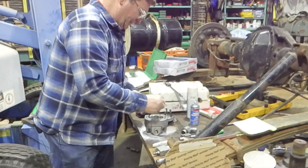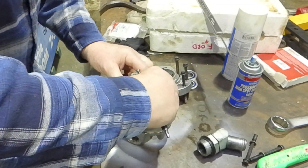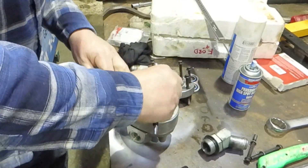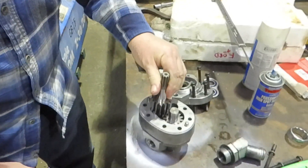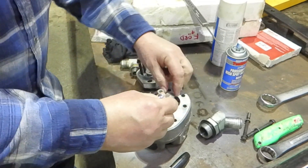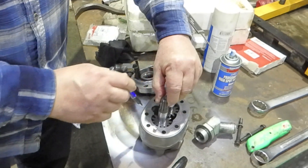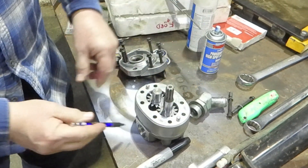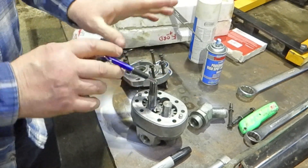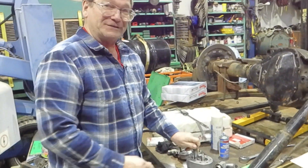As we're looking at gear pumps here — how does this gear pump work? Whichever way we're going, we've got a couple of gears. That one was easier to put in first; bigger handle, easier to put in later. When you turn the gears, the oil is going around the outside of these gears. There's oil going around on both sides — it just gets trapped in between in the open teeth, and the closed teeth push together and squish the oil out. I just made it come out the inlet — it doesn't go that way. It goes this-a-way. So that's one of those things you want to look at: look at the rotation. It's the outside that does the pumping.